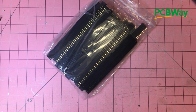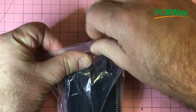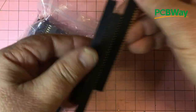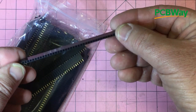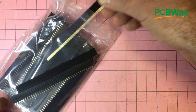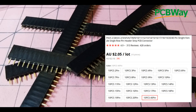I was running short of female headers, and then I ordered some which were the wrong pitch — so pay attention to the pitch. But these are 40 in a row and I think it's 2.54mm, so that's perfect for a breadboard. You can choose the number of pins you want; I've gone with the 40-pin. They're very useful.